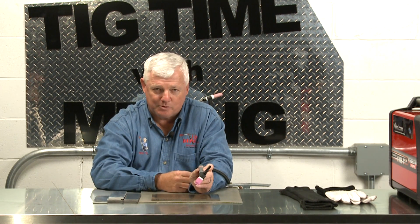Secondly, we have a power supply. Now if I'm getting ready to weld 4130 or steel, I'm going to set the power supply on DC negative. That particular power supply we're using will go up to 225 amps. I doubt that I'm going to need all 225 amps, so let's set the machine on 100 amps.